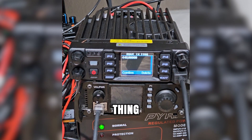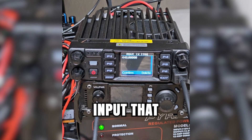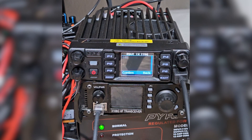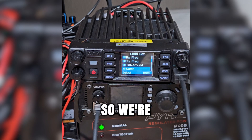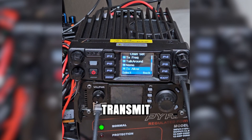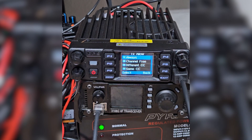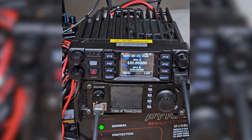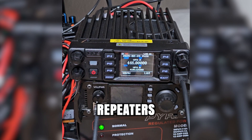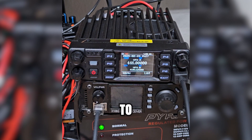Transmit frequency — we're going to do the same thing here. The transmit frequency is already set because I didn't mess with the offset; it automatically input that into the transmit frequency. Talk around — we don't need talk around on; we're not setting this up for a repeater. Channel name is already set to test. Transmit allow: you can either have it always allow, have it set so that if the channel is free you're allowed to transmit, or set it to color code free — which is what most ham radio repeaters want — meaning if there's a transmission with the same color code on that channel, you won't be able to transmit at that time.